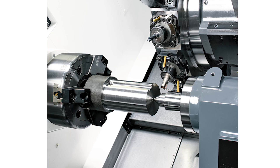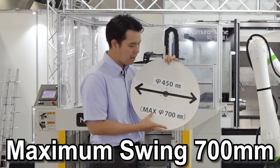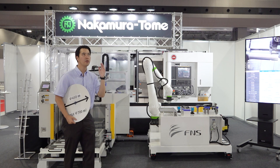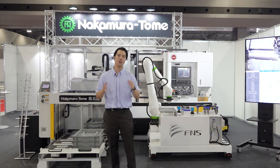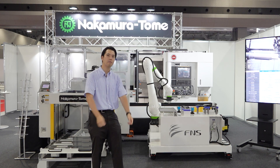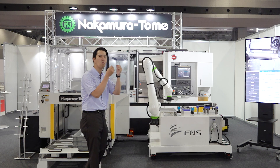Please look at the rest window. We have the inner space here — we call this the swing. This is one of the key specifications. This machine has a big swing specification with a maximum of 700mm. And if you add the part catcher option, the swing is 450mm — this is very big. You can easily put a 10-inch chuck or a special chuck in this big swing space. If you select the 12-station turret, the maximum turning diameter is 390mm, which is quite big. So you can handle both bigger and smaller diameter workpieces. This machine has great capability to deal with many types of workpieces.